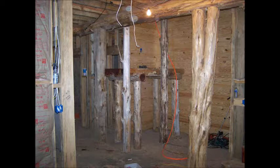Now it's time for the long post, which will be for the handrails and the guardrails when we get started. The post in the center of the platform has to be in and secured first. We'll take it out later on, and I'll tell you why later. But for now, it has to be put in and plumbed level. And this is where it's going to line up with our stringers when they come down.